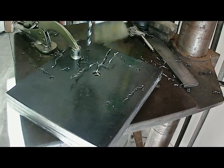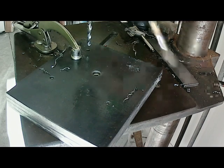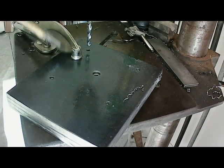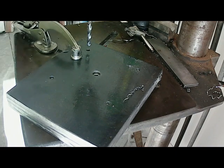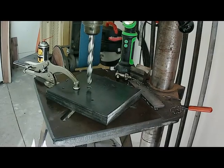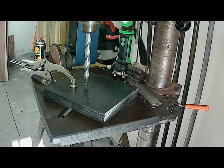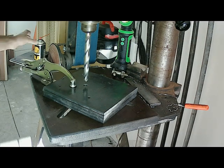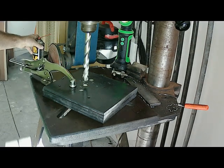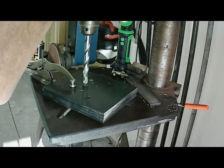It's working out right and I'm in no hurry, so I may just increase it up one belt to 480 and finish the rest of the holes. I got the half inch set up, slowed it back down to its lowest speed — 380.